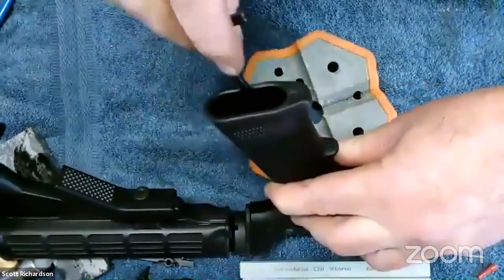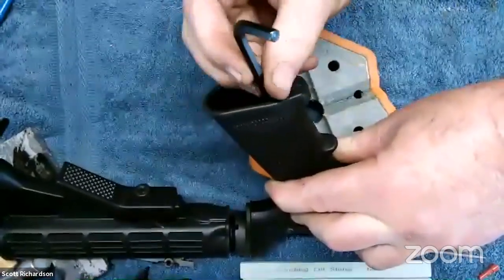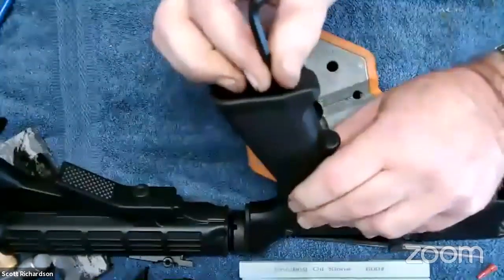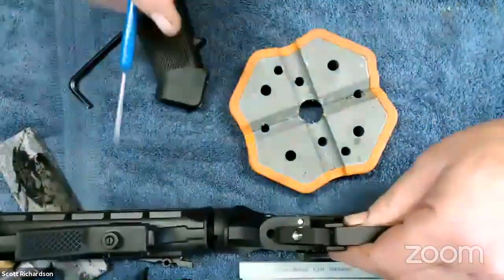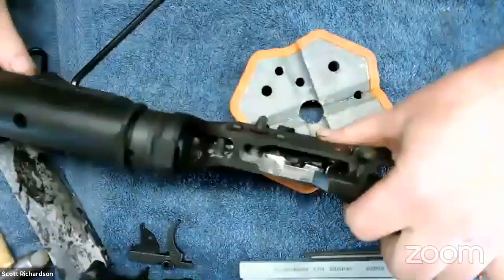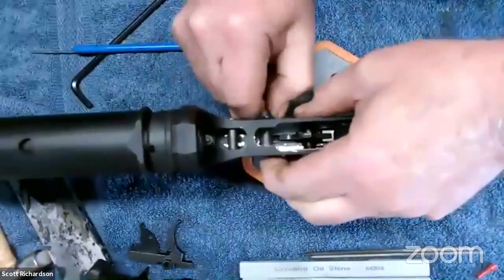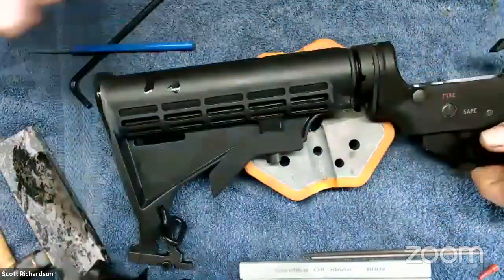It will launch if you're not aware of it — not like a garage door spring, but it will fly. You can see right there the little spring, and it's pushing up on the detent. The detent fell out right there — that's the piece holding the safety in. Now I can take the safety and wiggle it out. This is an 80% receiver I machined myself, so some parts are a little snugger than normal; you might need a punch to tap it out.